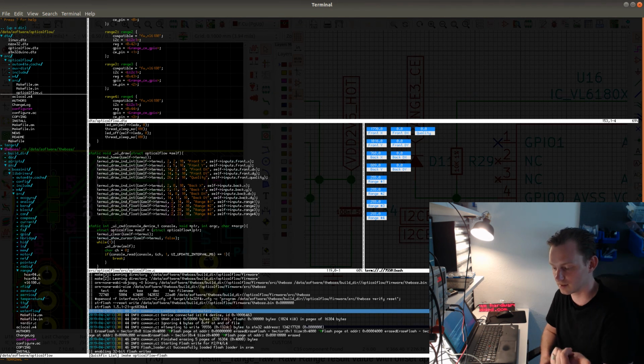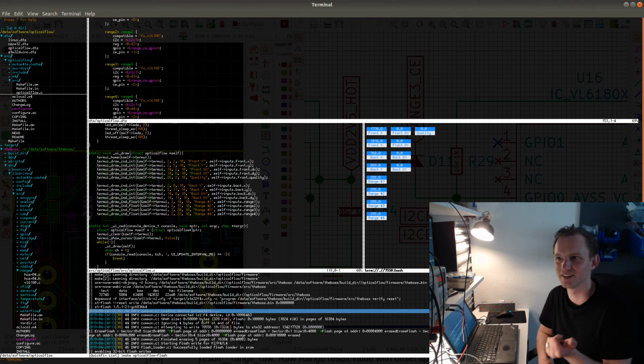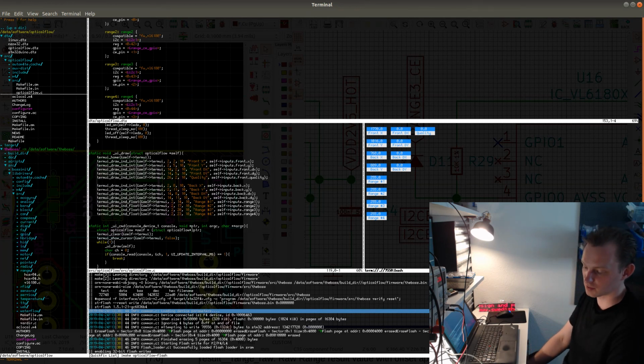And the datasheet says that the manufacturing process should be a no-wash manufacturing process. And I washed all of these cards in isopropanol. So, I don't know. Maybe it's something like that. I could try replacing the sensor and seeing if a different sensor works. If that works, then it's probably something to do with the sensor perhaps being clogged or something like that.